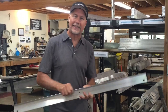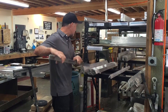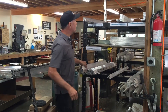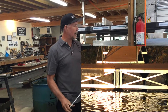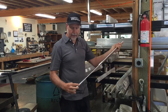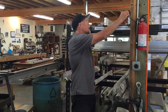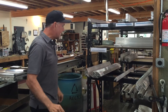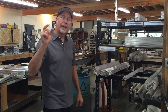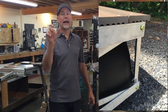So it gives you a very stiff, very strong, very nice-feeling dock. That's the basic angle that supports all of the deck. The strapping used in the cross braces is one and a quarter inches by three-sixteenths thickness — that's what you see in the truss. The upright angles are inch and three-quarter by inch and a quarter, and again it's eighth-inch wall.